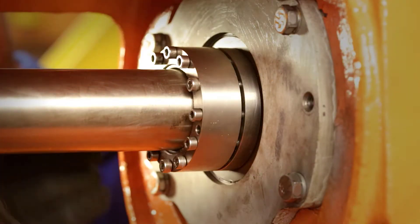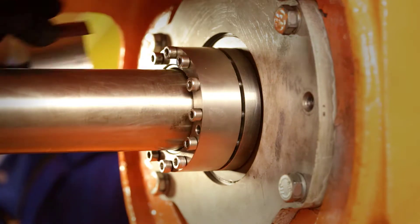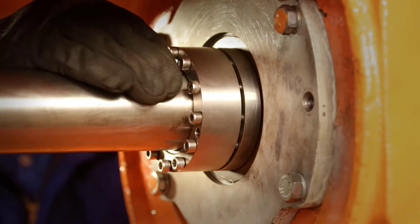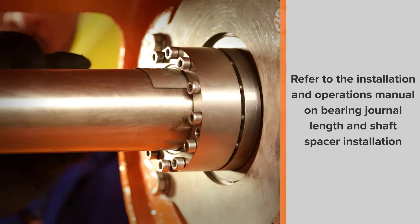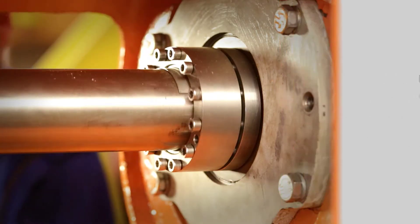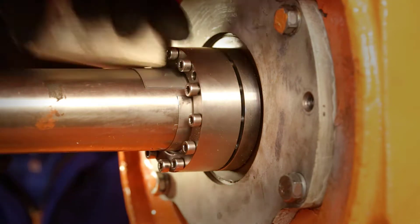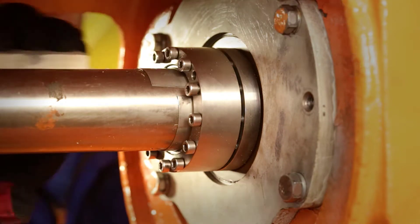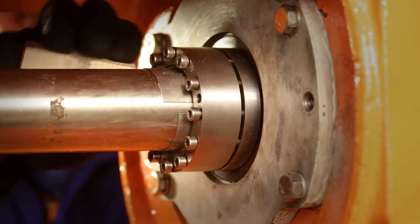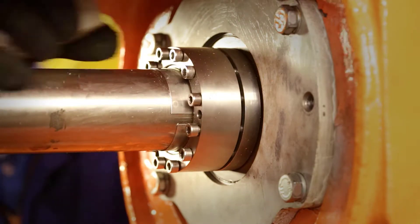Ensure all bolts around the outside of the collar are loose and can easily be spun by hand — this removes all the clamping force. For older mixers with a bearing bore on the shaft of 2 and 3/8 inch or less, you will need to install shaft spacers. Slide them in by hand between the shaft and the clamping device. Insert one on the top using a piece of wood to help slide it in. The shaft spacer should be nearly flush with the bolt heads — about a quarter inch from the collar to the edge of the shaft spacer. Install one on the other side as well. It's usually easier to rotate the shaft and install the shaft spacer on top as gravity helps it fit in.